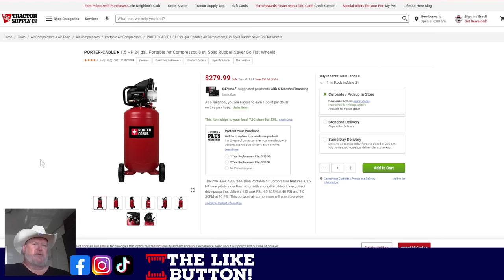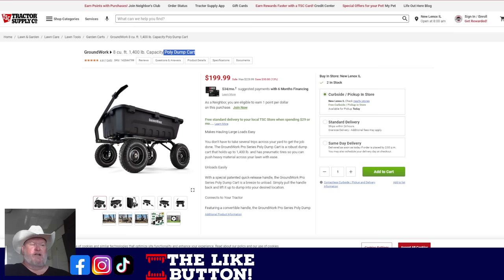The Porter Cable air compressors were, for the longest time, pretty solid. Especially the pancake air compressors, they were kind of a no-brainer for nailing and stuff like that. For a small shop kind of compressor, it's not terrible. It'll do 4.5 SCFM at 40 PSI and 4 SCFM at 90 PSI, which isn't something to write home about, but it's not terrible either. I think a more exciting thing is this polycart here.